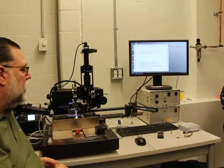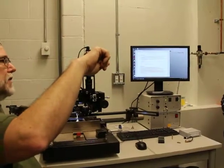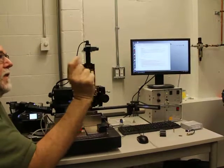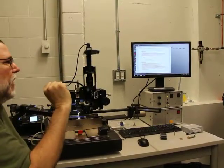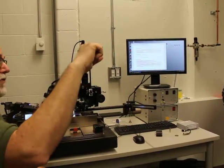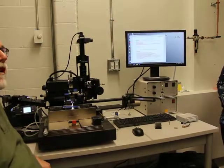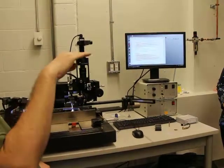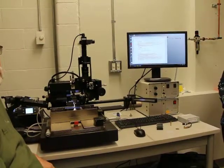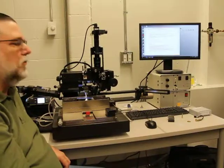And for gold to gold bonding, basically what you're going to do is come up really fast, as fast as you can, and once you get to where it bonds, that should only be 3 to 5 seconds. Basically you want to come up really fast with your heat, do your bond, and then get down and cool off as fast as you can, because if you stay up there too long, then all of a sudden you're going to have intermetallics and all kinds of other issues that could crop up from being at that higher temperature for too long once the bond is made.